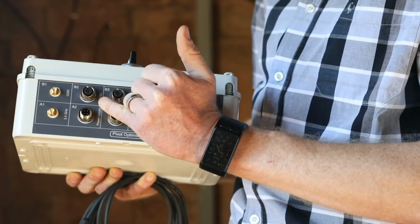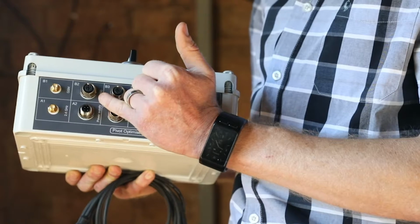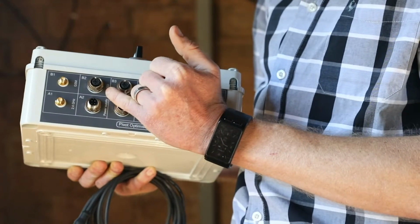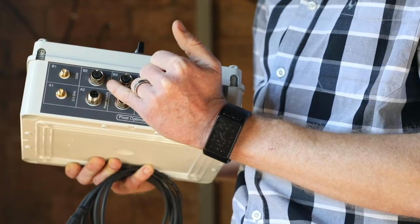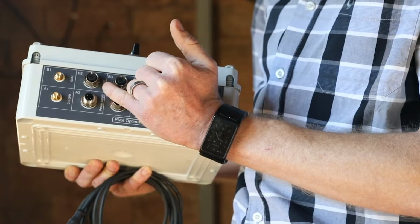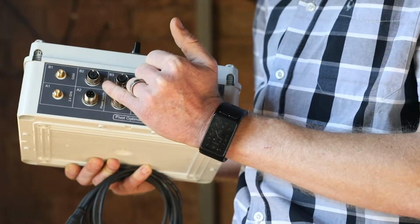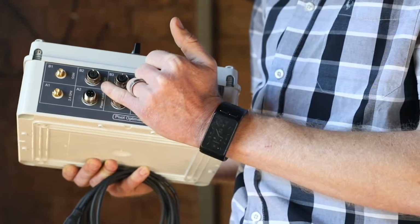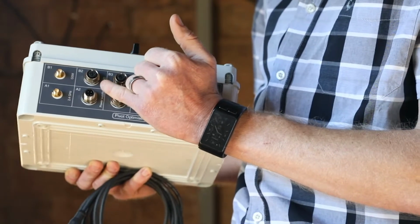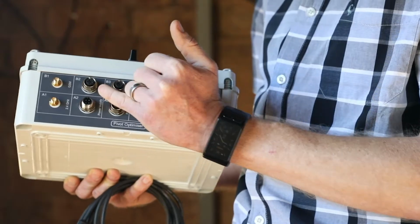A VSD connection. The VSD connection gives a run signal to the VSD as well as a speed signal reference. The VSD must be programmed to receive an external run command as well as an external speed reference signal. Please refer to our manual for setup parameters for different VSD models as well as a wiring diagram.